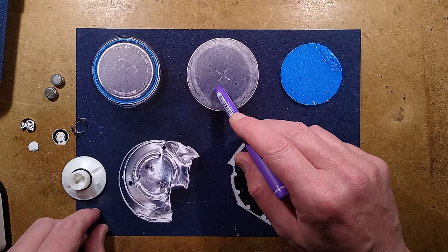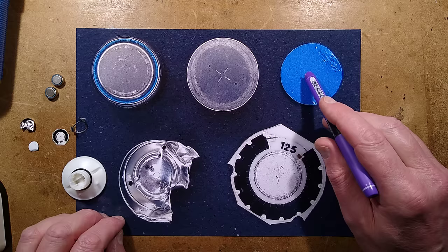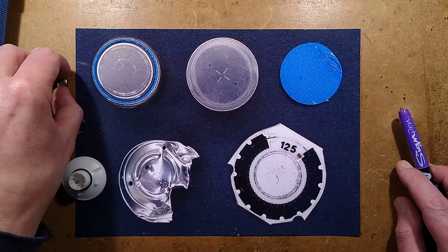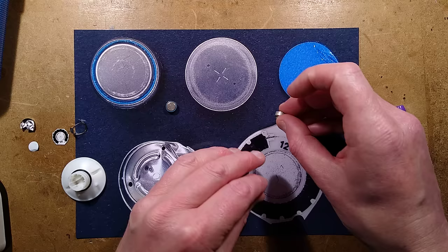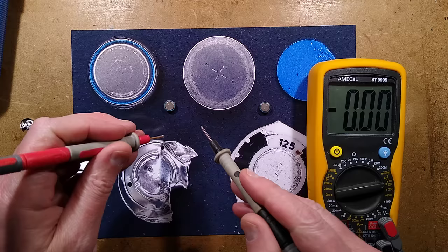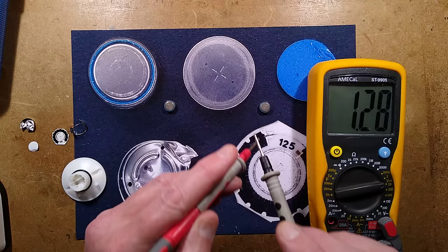The reason there was a cup joining these two cells together — I thought there was going to be some membrane in here with a chemical soaked into it causing electrolysis and gas that way. But no. I wondered why there were labels over the backs of the two cells. I peeled one off and it revealed two little holes, suggesting these may actually be zinc air style batteries. The one still with its label on reads about 0.4 volts. The one I've peeled the tab off reads 1.3 volts — which is, strangely enough, exactly the voltage of a zinc air battery once you peel the tab off it.